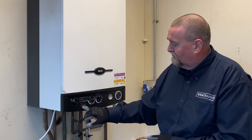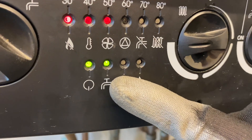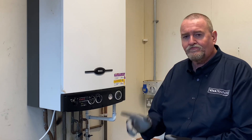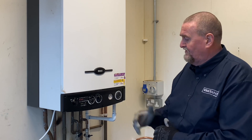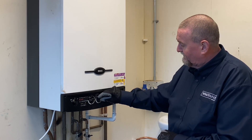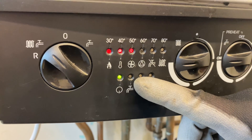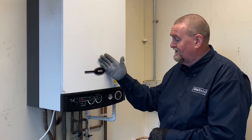The little green light on the bottom tells me I've got power - 240 volts going into the boiler. The next bottom light is a dual function: it comes on to tell me the boiler has a hot water demand, and it also tells me when it's on preheat. Turning the hot water temperature selector all the way around actually turns preheat on. Once I turn the tap off, that light starts to flash, telling me it's in preheat mode.